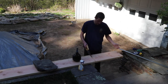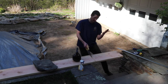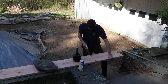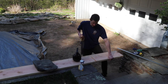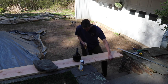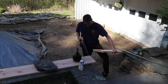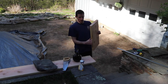As you get towards the end, I'll switch back to my dominant hand. Just want to hold the balance so that the piece doesn't fall and cause some splintering. Then as you get really towards the end and there's just a little tiny thread of wood holding things in place, switch and go backhand — that way you just prevent any big splinters from running down the board.